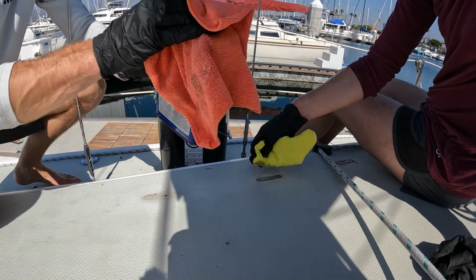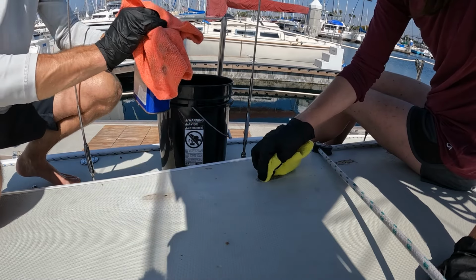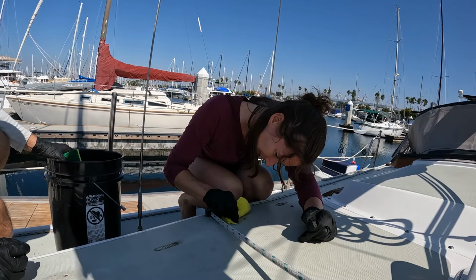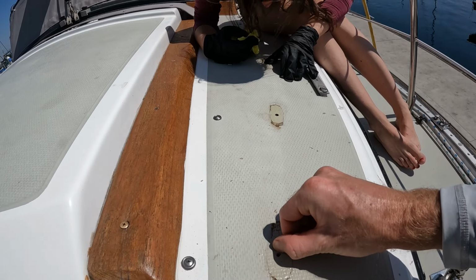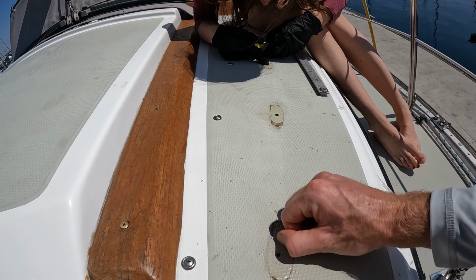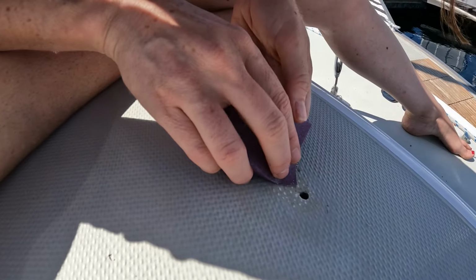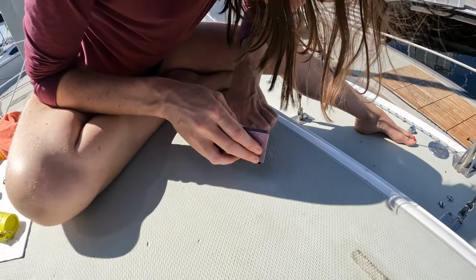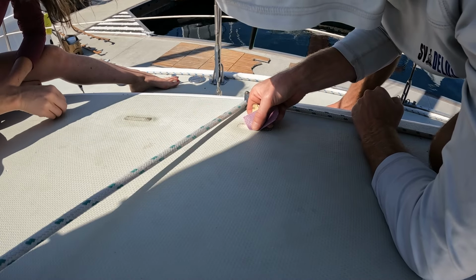It goes without saying that removing old silicone is a straight up pain in the ass. We started off with acetone, which barely did anything. Then we moved to using fingernails and cheap plastic scrapers, which also did next to nothing. After struggling with these primitive methods, we eventually moved to carefully, and I mean very carefully, sanding the surface down with 120 grit sandpaper.